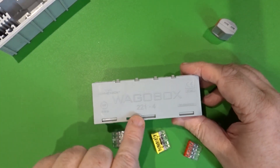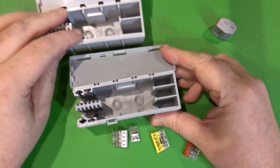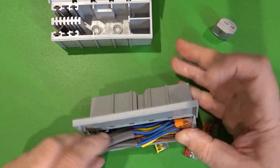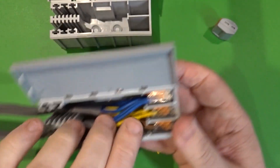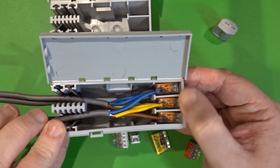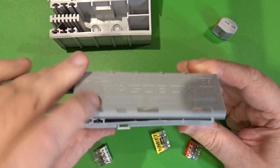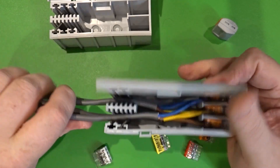To fix this, there's been a slight adjustment. The new ConnectBox — the 2214 — is specifically for the 221s. It has three slots and the 221s now fit very nicely into this enclosure. That will still achieve full compliance with BS 5733, with no movement. If you tried to put the older devices in this enclosure, they wouldn't fit properly — the new box is specifically designed for the 221s.